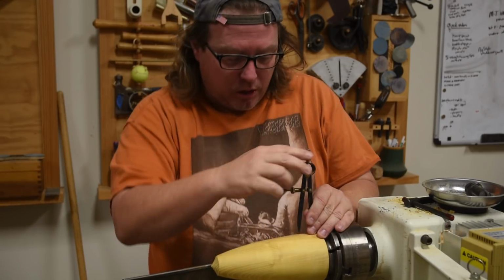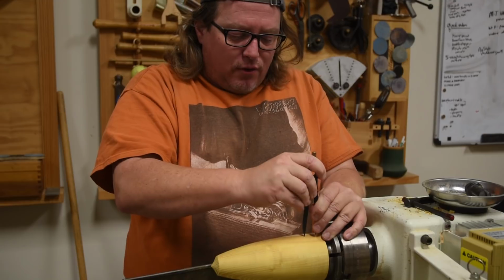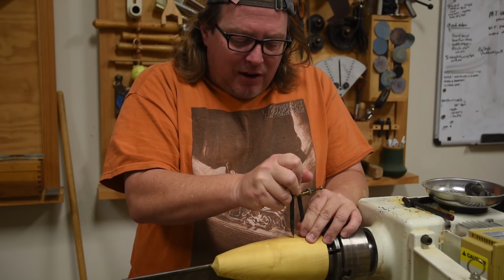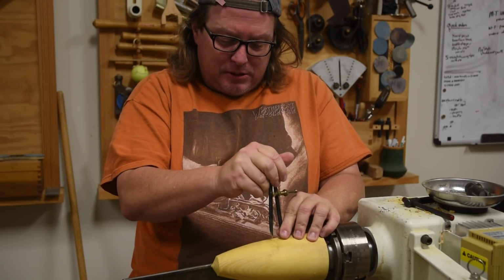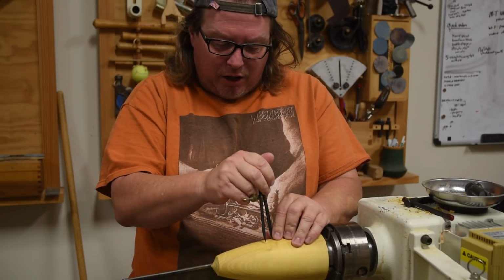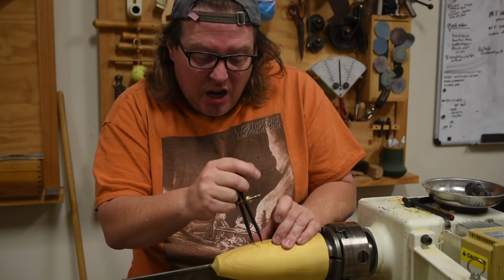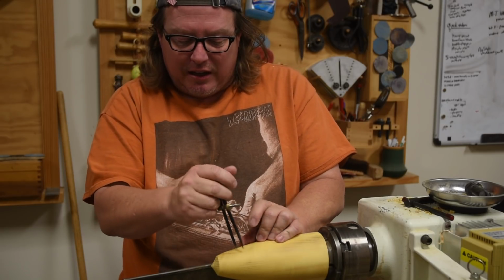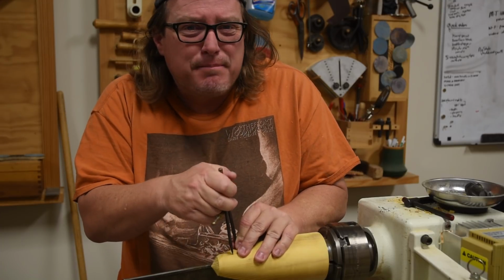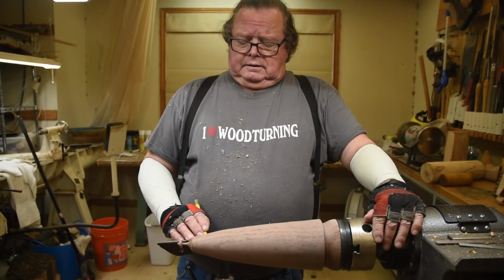But I've always kind of found that trees kind of their segments get a little bit narrower. So I can come over here, set my bottom segment, drop it in, move it over, and each step, maybe angle it out a little bit more. So I get a few more steps, and each step is going to be a little bit more shallow than the previous one. Plus, look at how much time this saves. I'm just walking steps off until I get to the end. An easy, much easier way to lay out my segments. Voila!